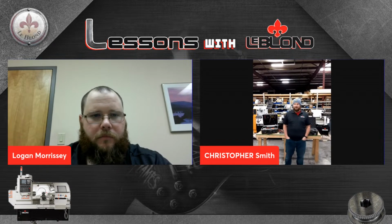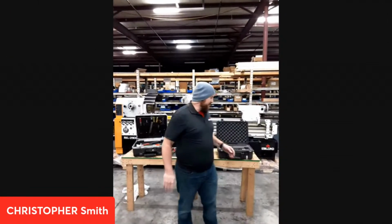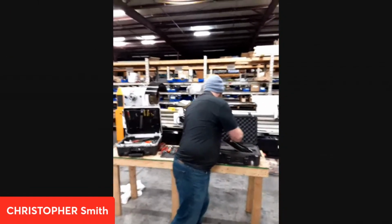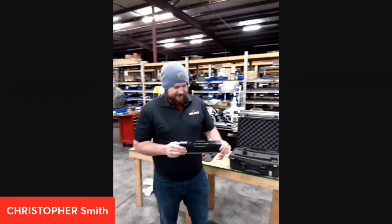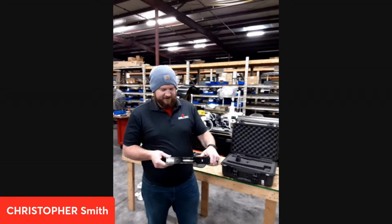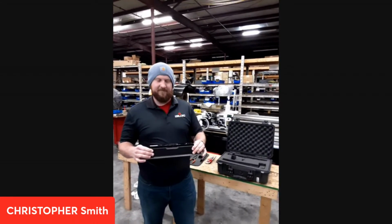Okay, yeah. Your run-of-the-mill level that you'd pick up at a hardware store is not going to work. You're going to want to get a good machining level. I use the Starrett. It measures within, what is that, five ten-thousandths of an inch. It's very precise. I mean, it's just hairs.